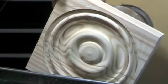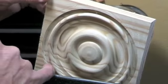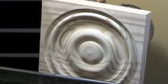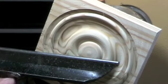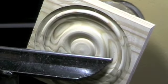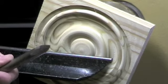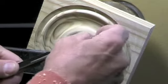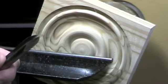It's a bad habit. So the only thing I've got left right now, it's a little bit dull right in there from my gouge not being real sharp. So I'm going to stop and sharpen that real quick. Okay, I reground the outside, and now I'm going to take my little fish hook sharpening tool and just polish off that burr a little bit.